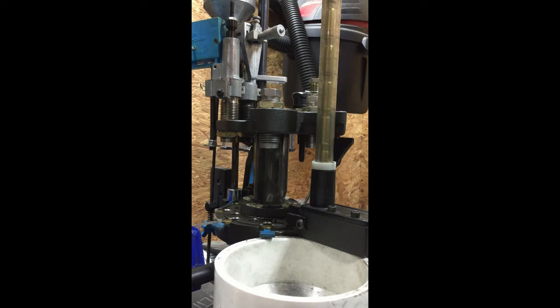That tool head was initially made for converting 556 to 300 Blackout and it works great for that, and it actually works really well for this too. You can also take a regular tool head and if you have a mill or that capability, you can just mill out a spot right here — probably just these two stations. That will work as well.